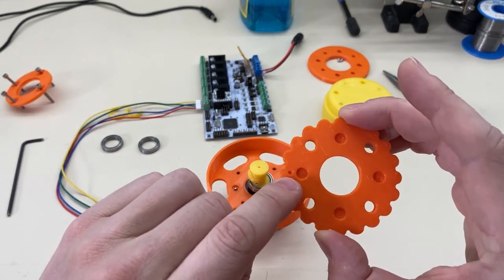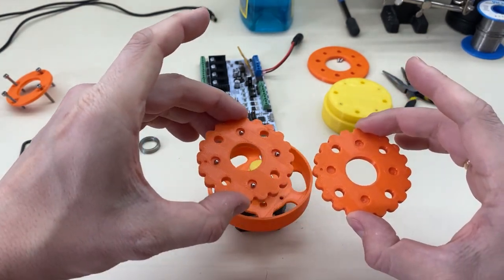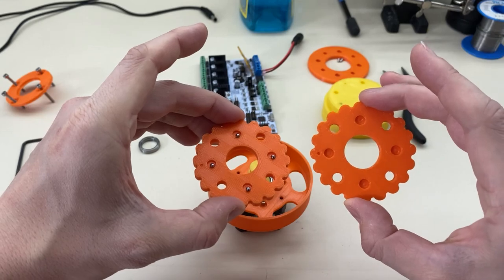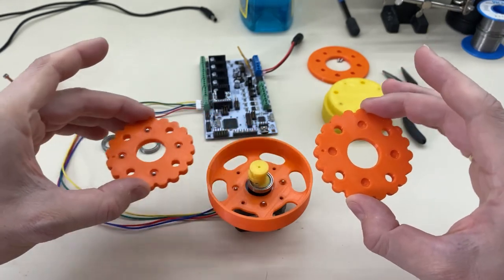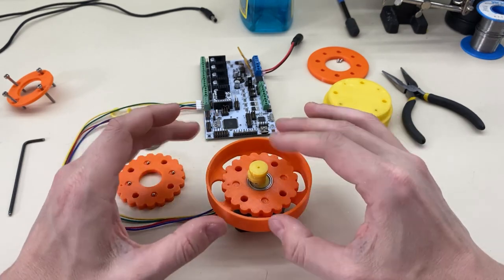You see there's a dot on here. This dot lines up with the wire on here. And this gear also has a dot, but they're not the same — it matters in a cycloidal gearbox. So there's layer one.